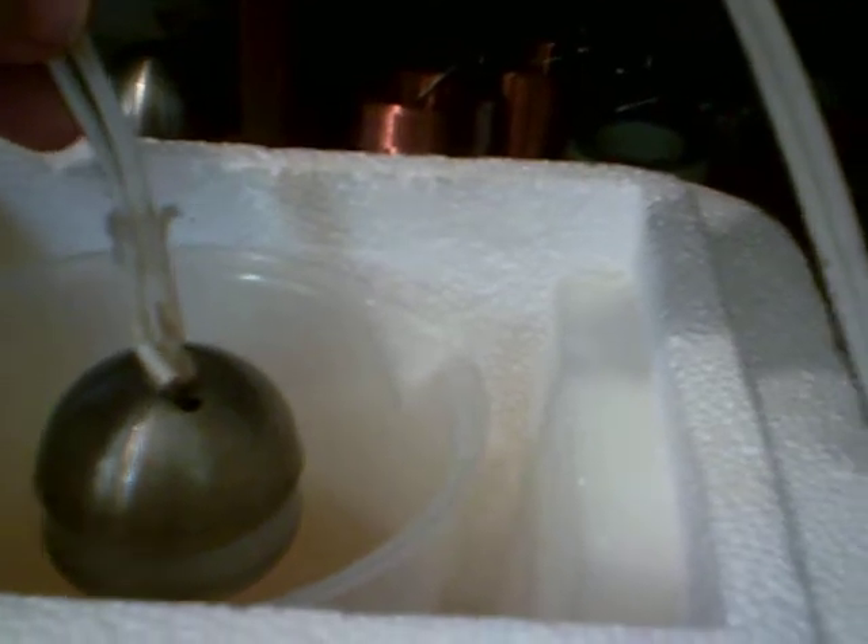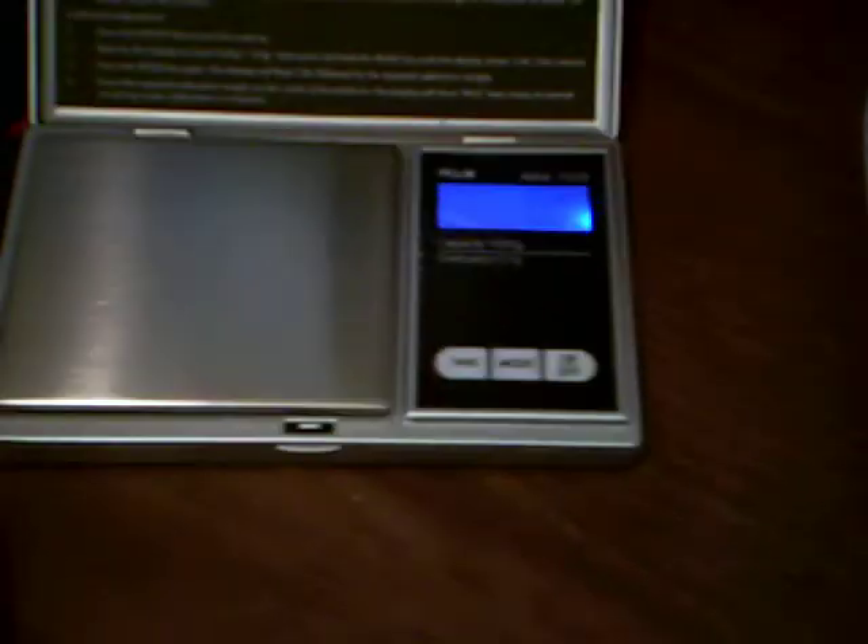I've hooked this up to my Davy Bell system which I've been experimenting on for some months now. It's immersed in a solution of tap water - very simple - and sodium bicarbonate for the electrolyte. A little red comes from rust over the numerous runs. I get the mass with my little scale here, which measures down to a tenth of a gram, and the temperature on my thermocouple probe. Everything's ready to go.